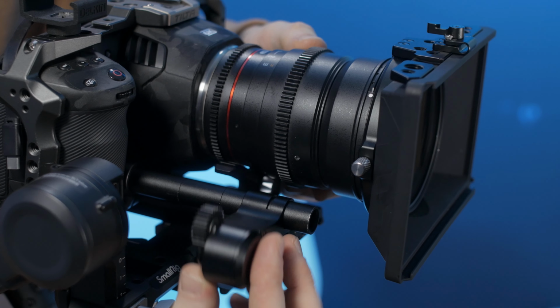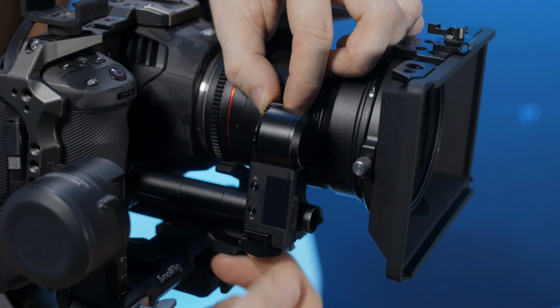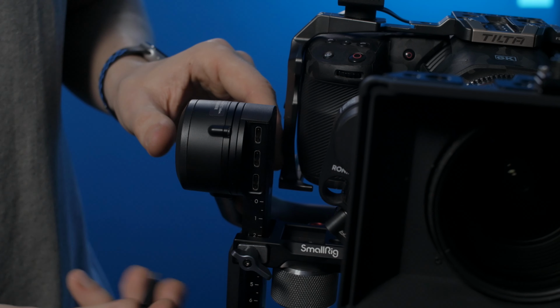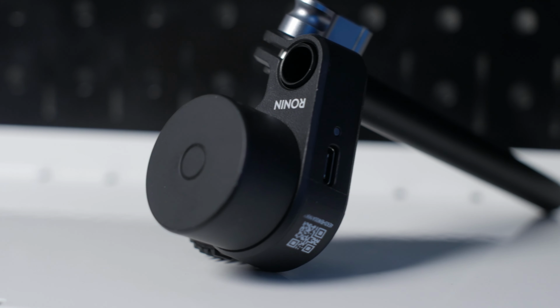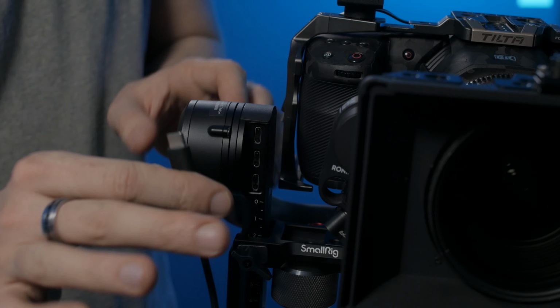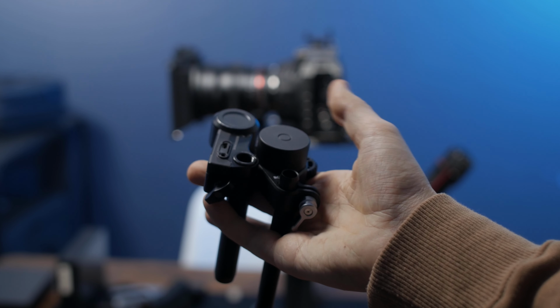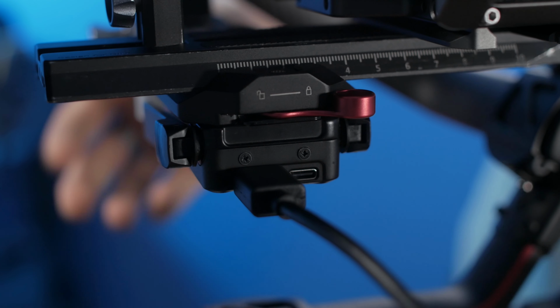With the first one, everything is quite simple, and here DJI helped us. I don't think that they designed this gimbal for such a purpose. The Nucleus Nano doesn't work with USB-C port number 2, which is designed to connect a motor from DJI, but it can work with another USB-C port, which is first on the gimbal and designed to control the camera. This way we can connect two motors at once. And don't worry, you can control the camera via the third USB-C if you connect it via Ronin Eye.